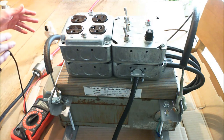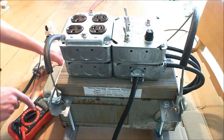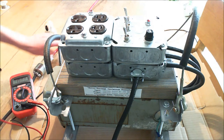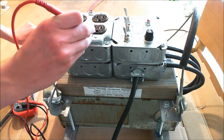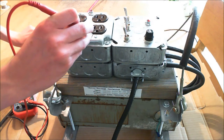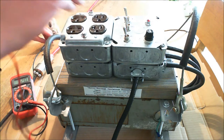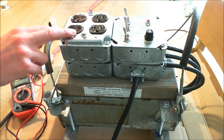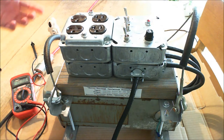And if that's connected to earth, and it's also connected to this output, then this has 120-volt potential against the power supply. You don't want that, because if you have 120 volts to the power supply and you test it — pretend this was a dead short — you're going to get 120 volts. You'll see 120 on that meter. That's not a good thing if your multimeter has its negative terminal connected to ground and your ground is connected to what you're measuring via the power company's transformer. It'll burn out your big multimeter, assuming it's chassis-grounded to earth.